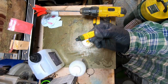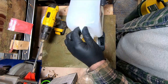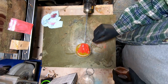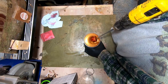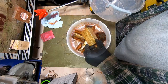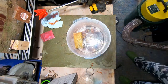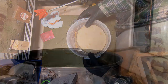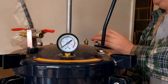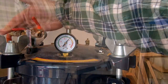To help pick out the gold, I added a few drops of yellow alcohol dye. With all three batches added, I placed some weight on top to stop the timber floating in the resin, and I placed the whole thing in the pressure pot. I added around 50 to 55 psi to the pot and left it overnight.